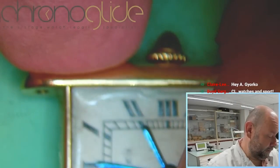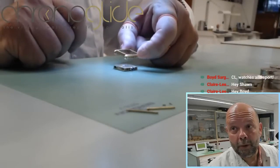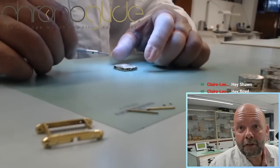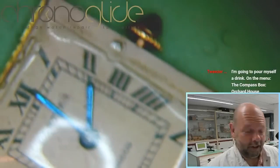Now we can remove the outer case without removing the crown. I just pushed it down and there we are. Don't try to force your screwdriver in between and just wiggle, because the gold is so soft you get some impressions — you really don't want that.